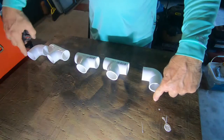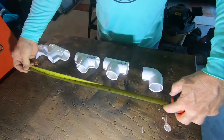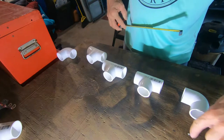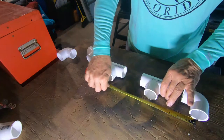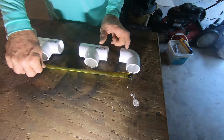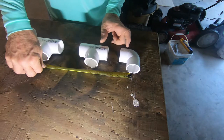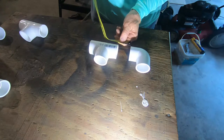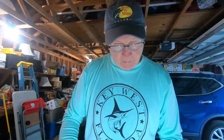We already said the center-to-center spread is 27 inches total. We want six inches between the center of each post. To figure out the length of the connector pieces in the middle, we measure the fitting depth — it's one-and-a-quarter inches on each side. The measurement between the tees is one and seven-eighths inches, and adding that gives us a total of two and a half inches. We add that to the center gap and those are the pieces we need to cut to make the six-inch on-center spacing happen.